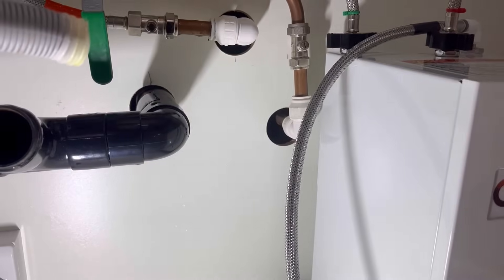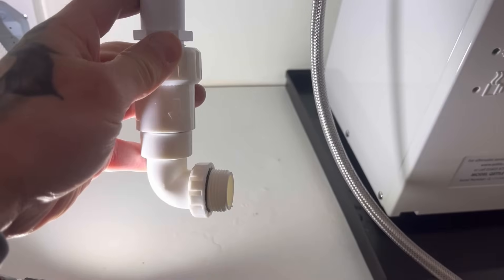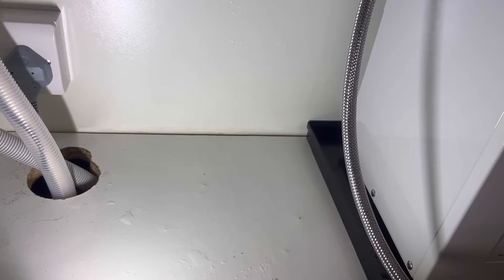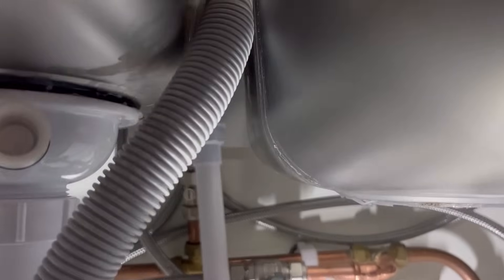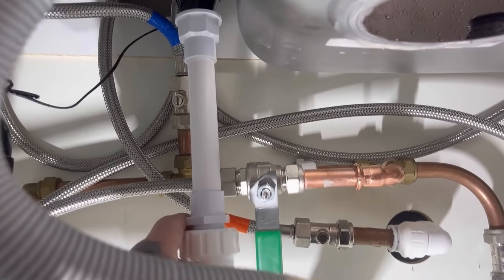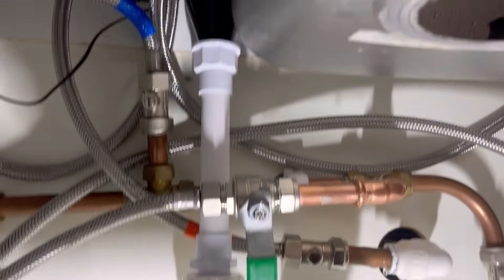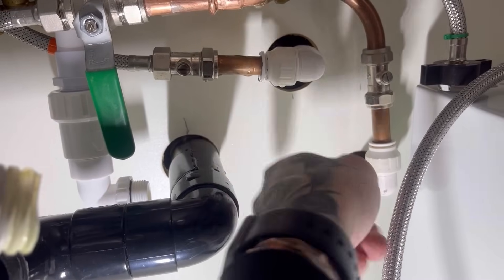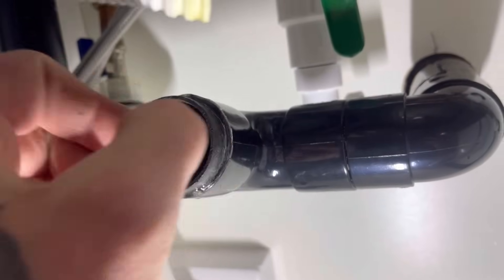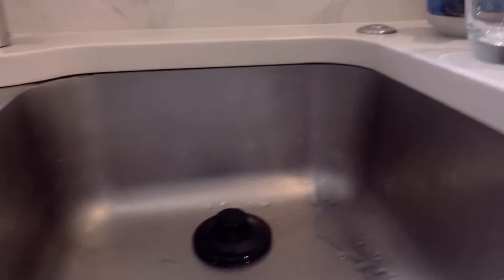Now all I've got left to do is the hard bit. The problem is I've got this humongous stand pipe which I can't cut down because it's solvent welded. The waste pipe is going to be right up tucked up there - that's the only place I can get it. It's got to be that long because that's like standard 300mm before the first bend of any unvented cylinder. I'm going to have to cut off this, get rid of that and start again because look how short they've left that - I'd never get anything on that. So all this is going to have to be rehashed. First, I'm going to drop the strainer.